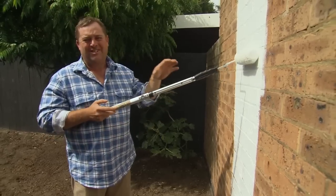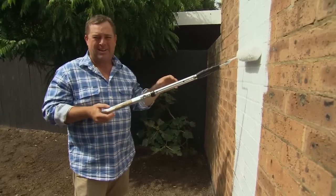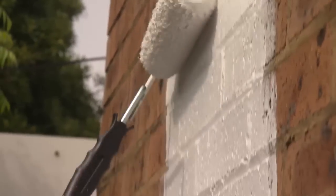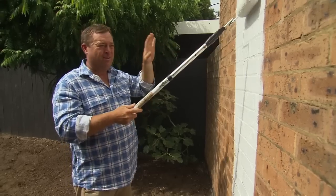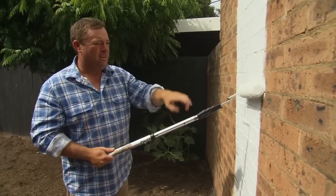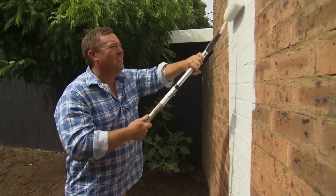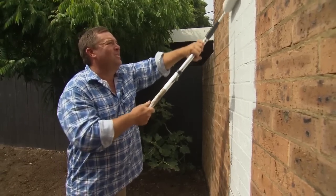Normally I go nice dark colors — I've probably mentioned black and domino a hundred times on Better Homes — but this brick wall we're going to paint white so it really draws your eye. We are going to put a couple of rusty screens on it to soften it. Got a really thick matte roller on there because the brickwork's got lots of texture. Put a heap of paint on the roller, go over it slowly, and concentrate on all the little nooks and crannies.